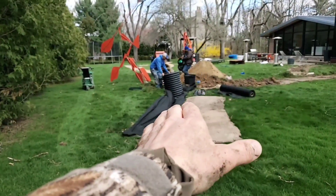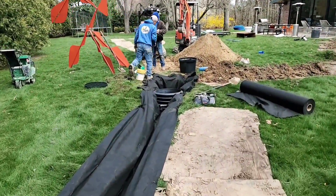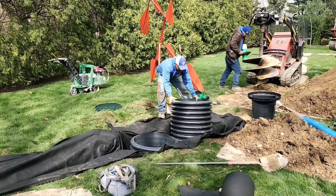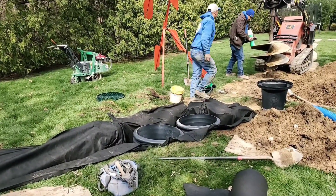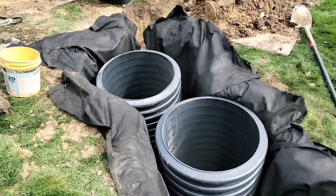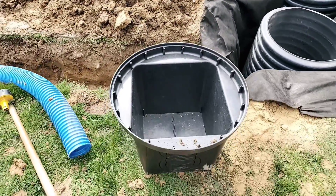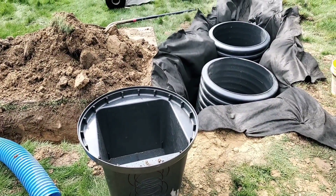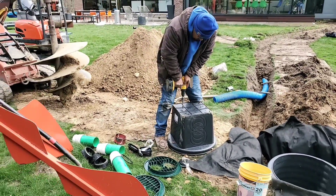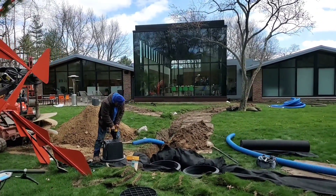You can fill that dry well up and have the overflow set up for bulk water. This soak away is built out of two 24-inch diameter, 48-inch deep dry wells with a leech line for overflow. You have to have an overflow. Another reason you need your soak away at a higher elevation than the lowest point of the yard is so that if your soak away becomes full and can't take in more water, you just need time for it to soak the water away. Then it can run into the leech line, providing more onsite storage and covering more area where you can soak away bulk water.